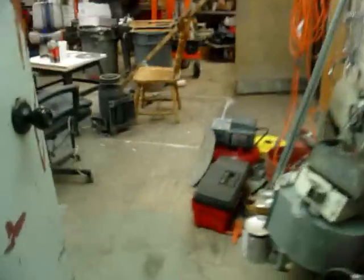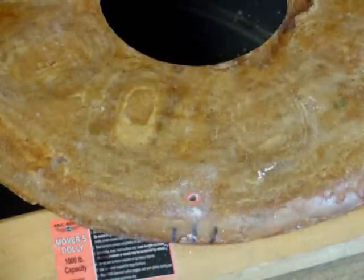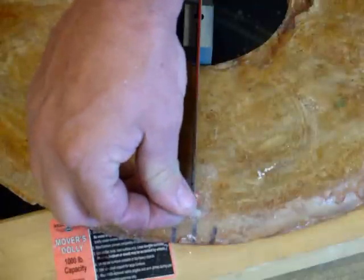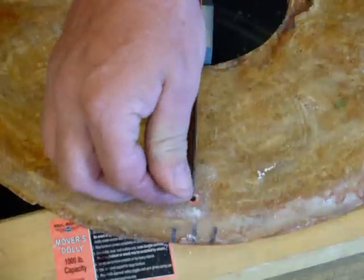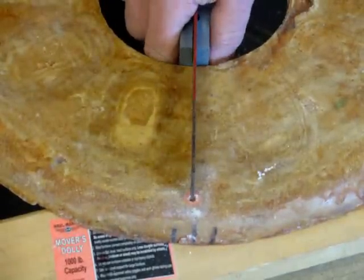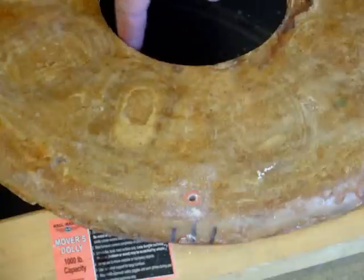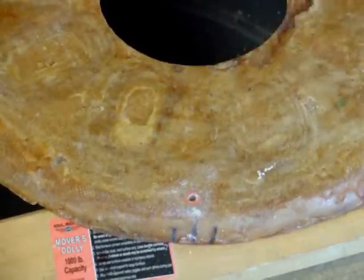We're back inside here. From the center of this, out to where I've got my dots drawn to hold the stator, I've taken this and made that right straight down to the edge. Looking straight down the edge of this, I put the very tip of a drywall screw — which is very pointy — right down on the spot so I'd have an exact spot, and I did the same on the other three. So these ought to come out pretty even. That's very important because the all-thread taking the place of the studs is going to be coming very close to this, and the copper's right on the edge. There's very little clearance here.